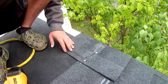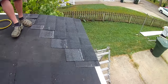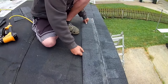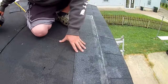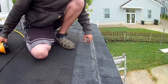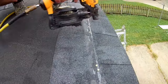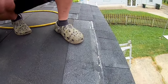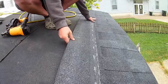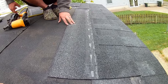So now we're gonna go back down to the bottom and show you kind of what we do from here. Start with our full courses, just like this. If you four nail, I'm gonna four nail like that. If you want a six nail, you can six nail. However you guys decide to do that, that's completely up to you and kind of irrelevant when it comes to starting shingles. The nail pattern is a whole other argument and story here.